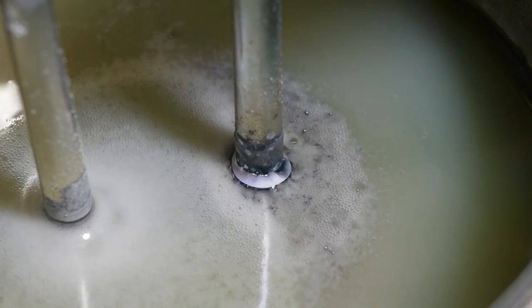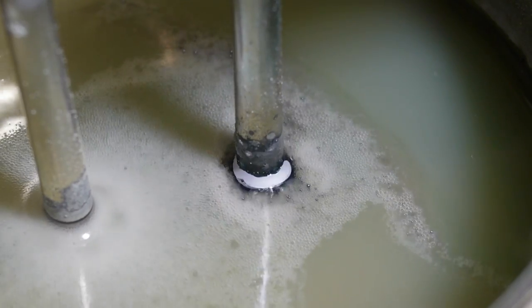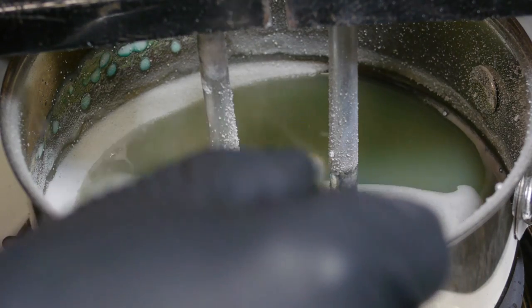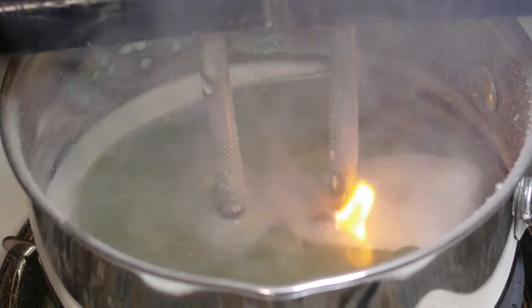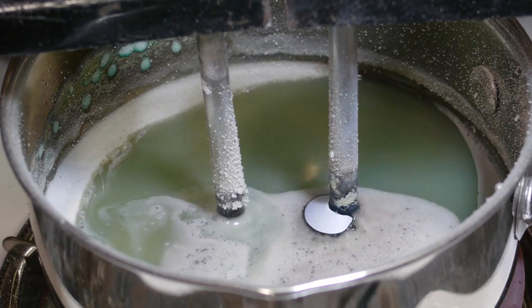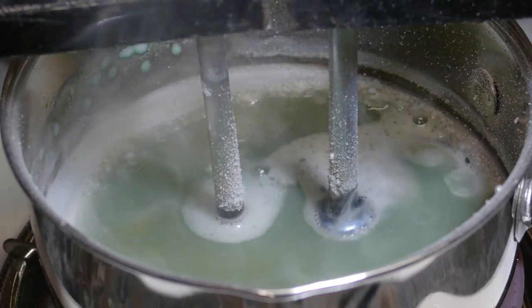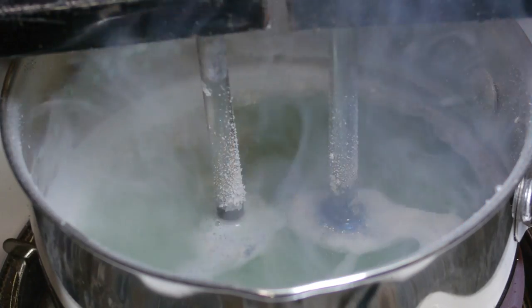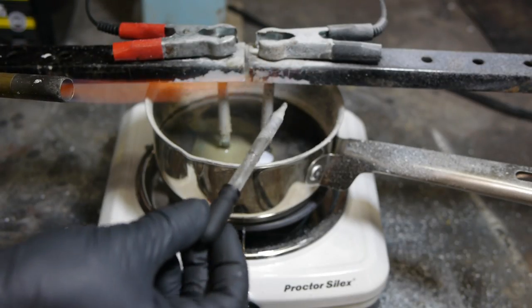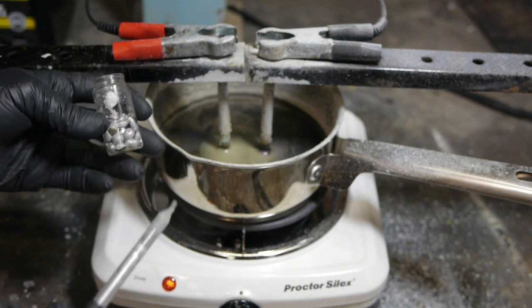I think I'm getting somewhere here. There's definitely a metallic liquid forming around the cathode. At this temperature sodium would be liquid, so it's looking good. This is definitely sodium metal and it's gathering together in a nice big drop that shouldn't be hard to collect. I tried dripping some mineral oil onto the surface of my molten hydroxide to see if it would help protect the sodium metal from oxidizing as it's formed, but I think it boiled away too quickly to add much protection. I tried letting this reaction go on for quite a while to see how much sodium I could make in one shot, but it seems like it's limited by a certain size where it reacts away into the air faster than it can form.